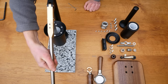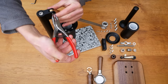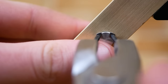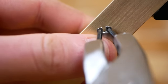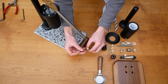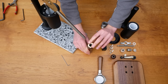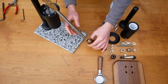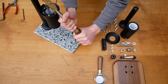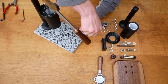Here's a good example of a design feature that only came about from years of use. Having tried threaded pins to hold the lever in place and found they had a tendency to come undone with use, we opted to use circlips for this application. We could have just applied a bit of thread lock compound — and in fact most manufacturers do this — but the thread locker becomes less effective once the pin is removed for tinkering or servicing. The handle is now slotted on; again we designed this to be as moddable as possible.